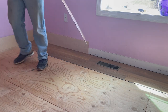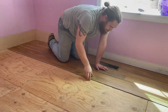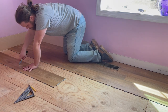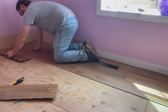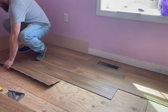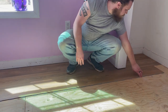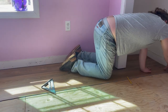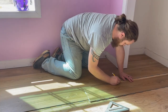With the first and second rows done, I can move on to the third and the next few rows as well. These will move much more quickly because I don't have any obstacles to work around. I started the last row with a half piece, so this time I'm going with a full plank, then another full plank right next to it. I line the next plank up with the half piece I installed earlier, mark it so they're the same length, cut it, and install it. My half pieces are slightly under half the total length of a plank — this way I can keep the cutoff piece and with one more cut have the next half piece with almost no waste. I switch to the other side of the room to finish up these rows, using scrap pieces to cut the small sections I need. Just remember to keep your eye on the pattern and maintain your quarter-inch gaps between the flooring and the walls.